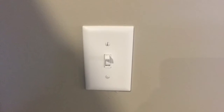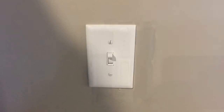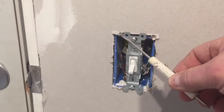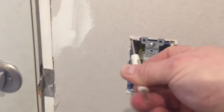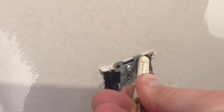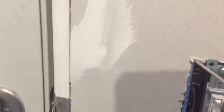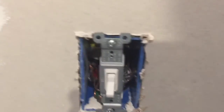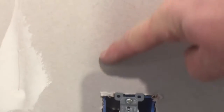If you don't have an outlet on that wall, you can use the switch. Take the cover off the switch and take a real small object and work it in between the box and the wall — it looks like it's hitting, so there's a stud on this side. Check on this other side and it looks pretty empty, there's a cavity inside. So the stud is over on the left side of the outlet box. I can push this in and it kind of hits — so I'm hitting the stud here. I can measure 16 inches over from there and I'll know that I have another stud.